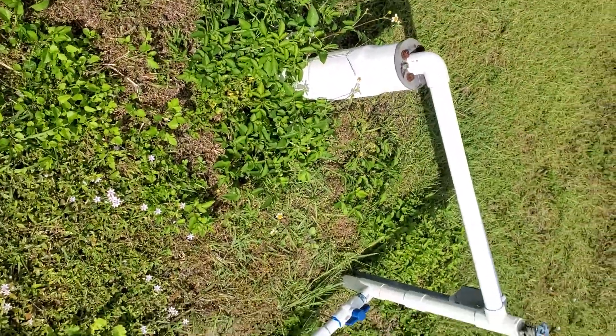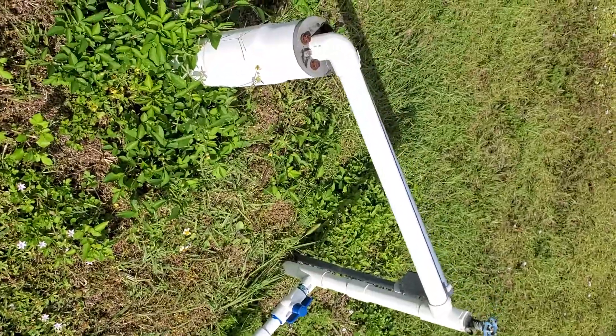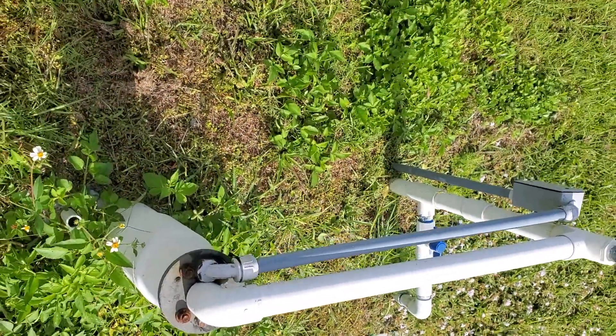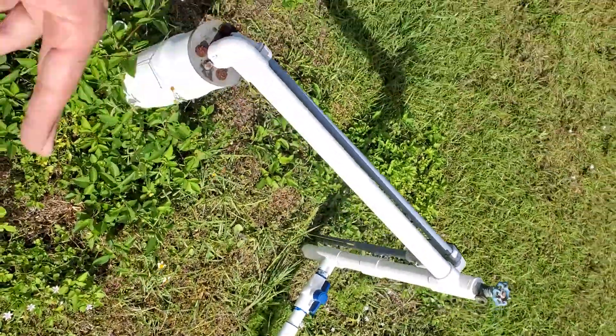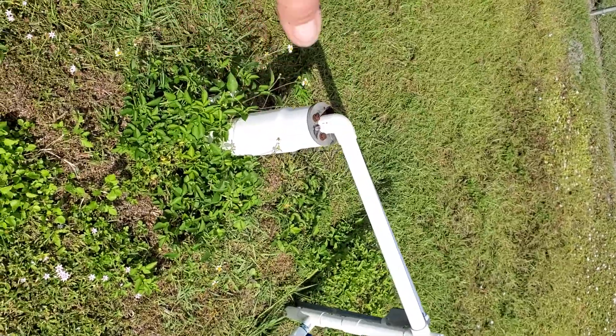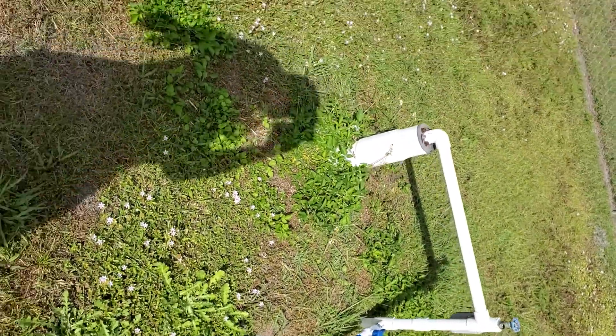So this is in your well in your backyard — looks pretty good, nothing out of the ordinary. One thing that you're going to need to do is you're gonna need to sanitize your well. You put chemicals in the well and recirculate the water and let it recirculate so that way you sanitize everything in the well from the casing down, from the water level down.